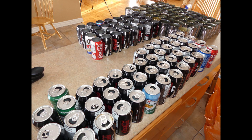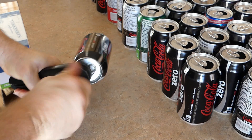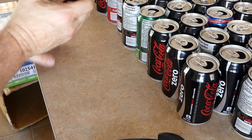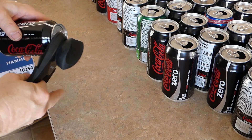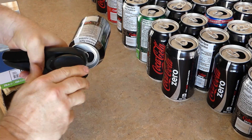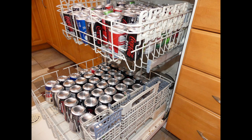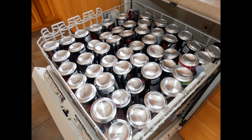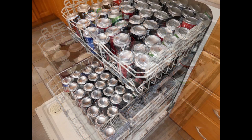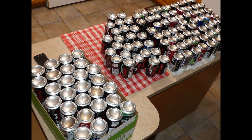Solar air heaters require a significant number of pop cans, ideally cans without any dents. It is necessary to thoroughly clean the cans, but first you need to remove the pop can's top. Having just completed a few hundred of these, I suggest doing this as you collect the cans, not when you have a large pile, as the task quickly becomes tedious. I used the dishwasher to clean them — it was easy — and then set them out to dry completely.